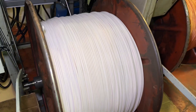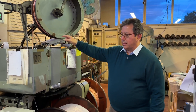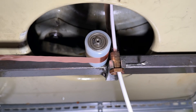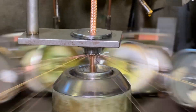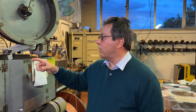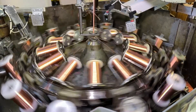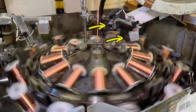After making the dielectric on the cable, we are placing the bobbin full of dielectric here. From this position, we are passing the cable lead inside and matching it with the foil. This is a copper polyester foil. There is a load cell which gives exactly the same amount of tensile strength so that when we arrive at this position, we can have exactly the same force while overlapping the foil around the dielectric. The foil is wrapped around just a fraction of a second before making the braid, and both things are done in a fraction of a second. There are two sensors which check, and if the foil is not placed in the right position, they will stop the machine and give an alarm.